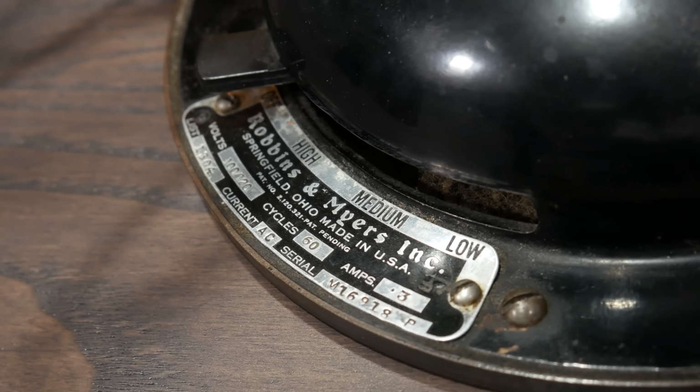This would not only be annoying, but could hurt the motor. And in a fan like this, potentially start a fire. Now, to be clear, modern fans are required to tolerate being stalled for indefinite periods of time without burning your house down. After all, you could have left it on low, had a power interruption, and not get the benefit of the start-in kick. New fans will either have some sort of thermal protection or simply have a stator design which can't possibly pass enough current through it to get dangerously hot.